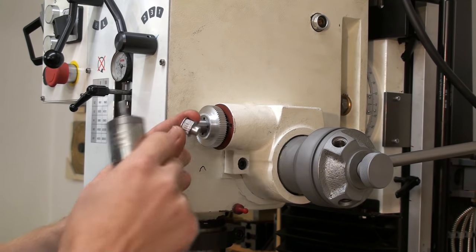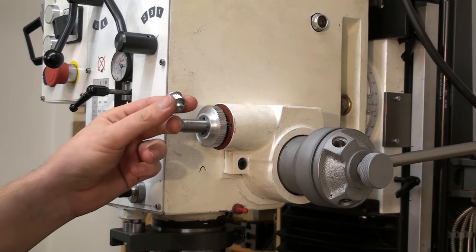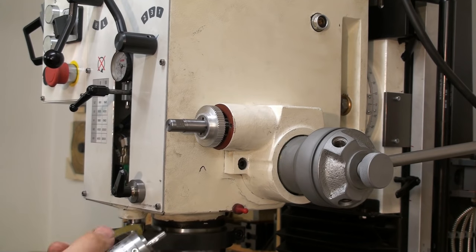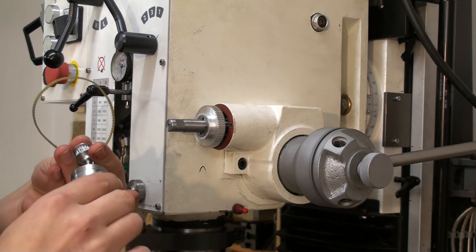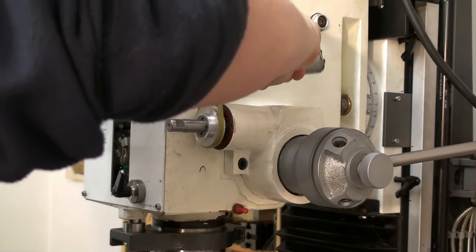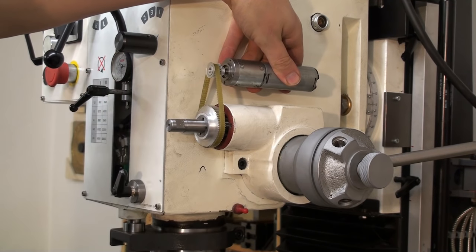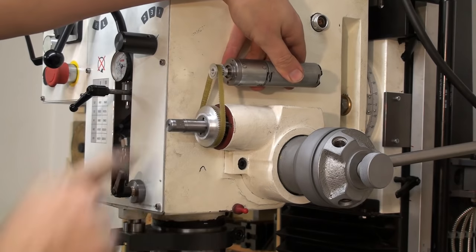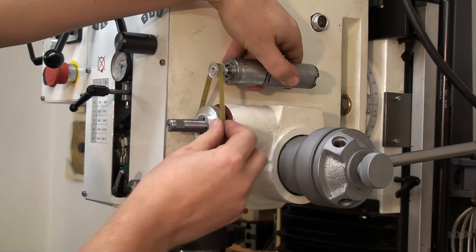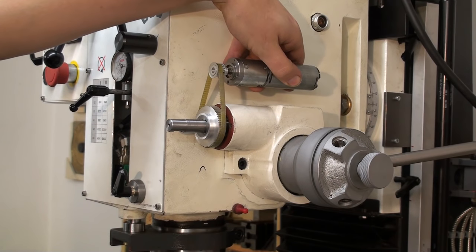And I have a 19 teeth belt gear here and 60 here. So that all will go together like this. The motor will drive the worm shaft via this belt, which I also had in my junk box. And this will spin and will turn this shaft.